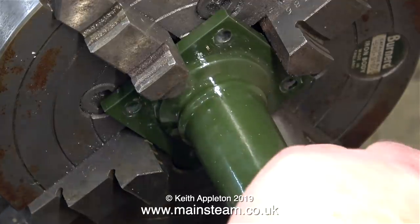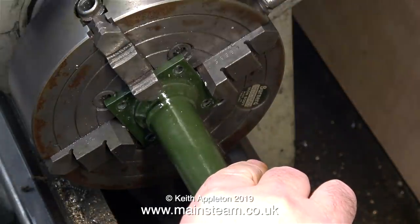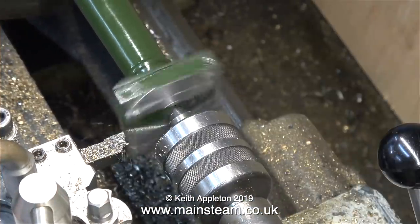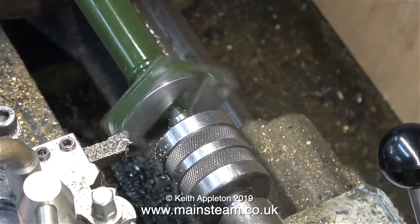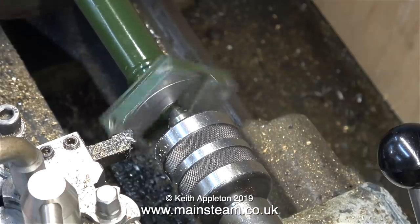Over now to the lathe. I've fitted the four-jaw chuck, and now I'm going to tightly clamp the base of the column into the chuck. I need to get this part to revolve concentrically, because at the other end there is a centre. The point is it's the centre that needs to be concentric, not the column. The column is just as it was cast and it's not very true. But before I fitted the live centre into the centre hole, I made sure that was running true.